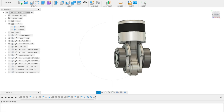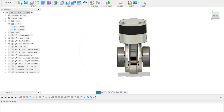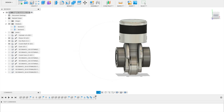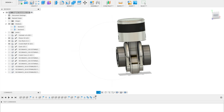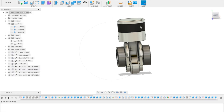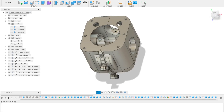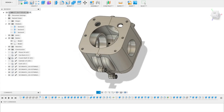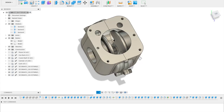This is a little more complicated than the connecting rod and piston because it has multiple parts, and it's important that these things are held together well and securely. The only thing holding these two halves together is the bearing journal. Basically these two bearings will need to be held really well together, and the way I'm doing that is with the crankcase. There's a cavity for each bearing, and when we include the crankshaft you can see how the bearings sit in there and the whole thing fits well.